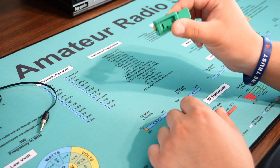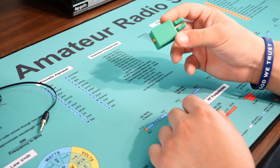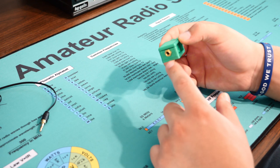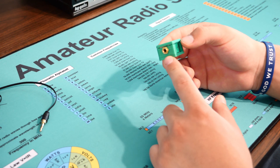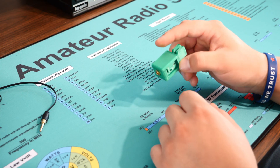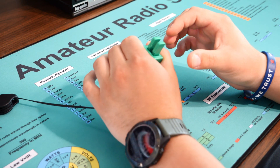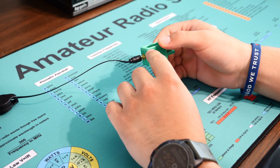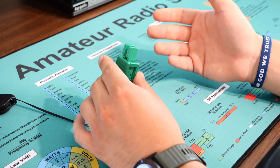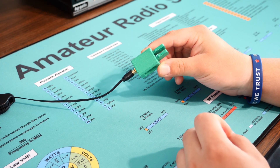The next key is the K6 ARK 3D printed paddle — a super tiny QRP key. I built this one about a year ago and so far it's held up really well. Same concept: 3.5 millimeter plug on the back, with little screws you can tighten to adjust contact spacing. The only downside is it's so small it's hard to fit in your hand. You can glue some magnets on there or use Velcro, but it's a great little paddle to throw in your bag as a backup. I've built probably 10 of them and gave them away to friends and family.